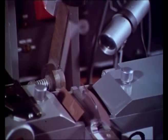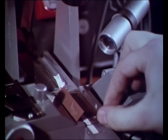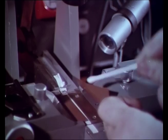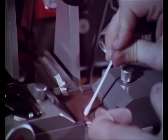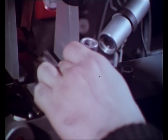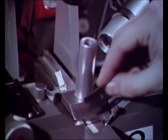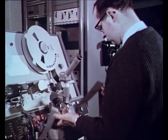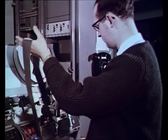By lifting the tape ends, the adhesive splicing tape is positioned beneath them. They are then pressed firmly onto this with a swab stick. The trimming block is placed on the videotape and the surplus splicing tape cut off. After the tape is unclamped and lifted out of the editing block, the join is complete.